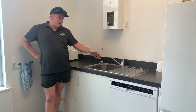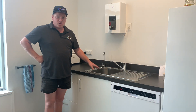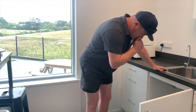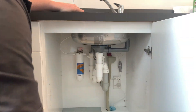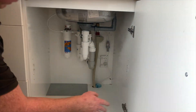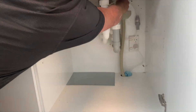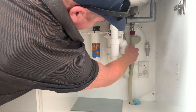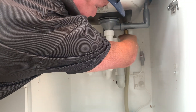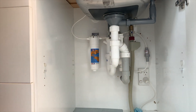In this situation, if you get a leak on your filter tap or your dishwasher, we can come under the sink and normally isolate it so you don't have to call someone out then and there. As you can see, we've got the filter and the dishwasher equipment going down here. Now if we follow the pipes from the dishwasher up, we can see we've got a valve here. In this position it's currently on. Now, if we put it to the side, essentially putting a fence across here, stopping any water going down. Now that's isolated, the leak in the dishwasher will stop.